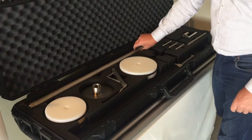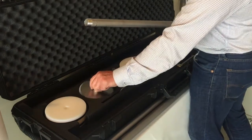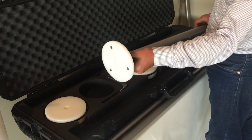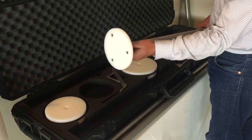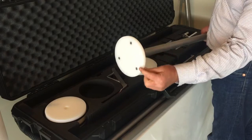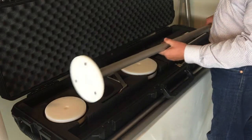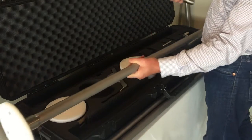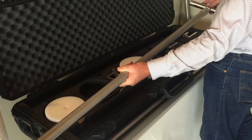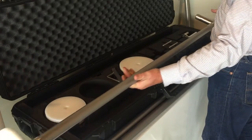Next we have four push rod tools to enable you to remove and push out up to five elements. The push rod has an end cap which screws on just like that. It has anti-scratch plastic on the outside to prevent you scratching the pressure vessels. On the other end we have the handle, which screws on the other end, and then you're ready to push out your first membrane.